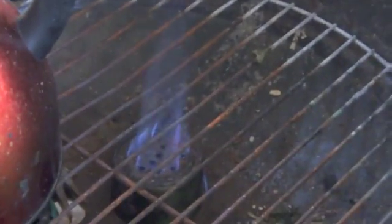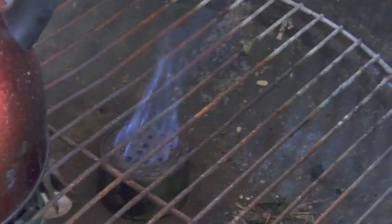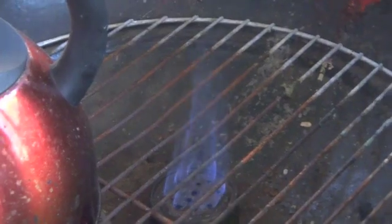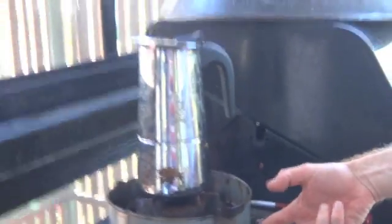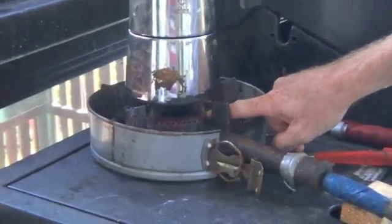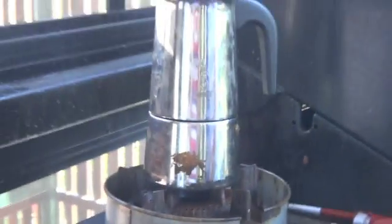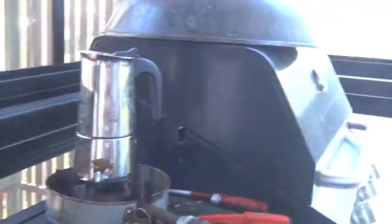This is our little burner we've made out of a tuna can where we've put nail holes from the inside out to create little gas holes and it mixes with oxygen. This is a post-oxygenation burner where the oxygen and burning occurs at the actual site of where the flame is. Over here we have a pre-oxygenation burner where the oxygen comes and is mixed with the gas and burns at the point here, which is more efficient but can be a little bit harder to regulate when you don't have good quality gas or you have plenty of wind. The others are far more stable flame on most occasions.